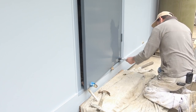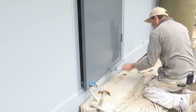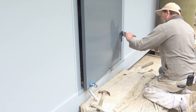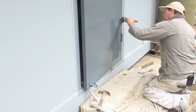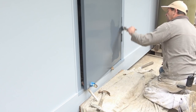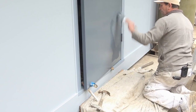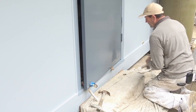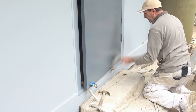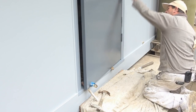Now if you were to hit your door frame, I wouldn't worry — you can always touch that up, but you don't want to go painting the door again. So I wouldn't stop to clean the door frame off. If you hit the door frame, just leave it, finish your door, and then come back and clean that up after, because the door will take longer to repaint if you let it dry than it will to touch up that bit of door frame.